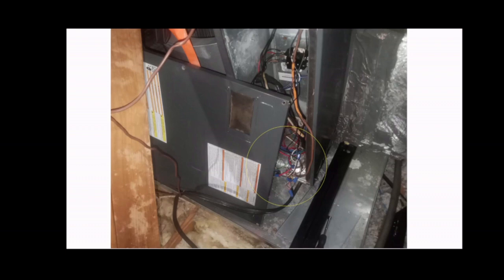Make sure again that you turn off your disconnect before you remove fuses from the disconnect to check those. And I'm assuming that you know that you do have power in your home. So once you clear all those, once you know that all those things are good, then you can go ahead and keep going and checking for other problems, which we'll again go through in this tutorial.